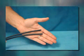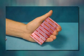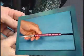When installing cables smaller than 0.2 inches in diameter, the cable diameter must be built up to the minimum requirement and the cable itself protected from heat. To accomplish this, wrap the cable with a SCOP adhesive pad once the aluminum tape has been placed and prior to positioning and recovering the heat shrink. The SCOP provides several benefits. It builds up the cable diameter, it contains adhesive for sealing, and provides heat protection for the cables.